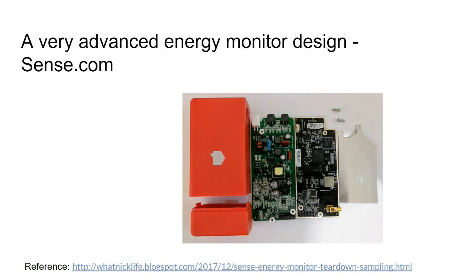This is a very, very advanced energy monitor design from an American company called Sense. You can see the link below to the teardown I did for it. It uses a host CPU, which is a Sitara CPU from TI. It uses a CPLD to do its maths, and then has 2 megasamples per second sampling of the energy on the analog channels. Very, very fast sampling. And it can apparently do machine learning of the energy signatures and such.